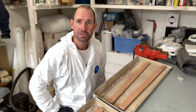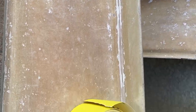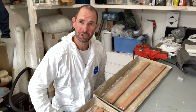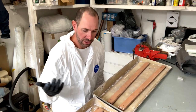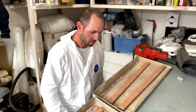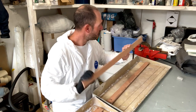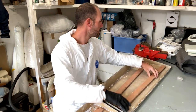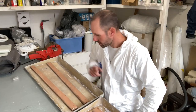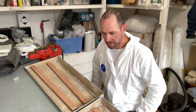I've just spent a wonderful hour or two cleaning up the inside of these locker lids outside. I didn't record it because grinding polyester is a horrible job at the best of times. This had a mixture of paint and gel coat and flow coat on the inside which I can't really bond to — it's now all off apart from a few bits. I've marked up where I want my little wooden formers and stringers to go in, so the next job is to glue them on. Once that's gone off I can lay up glass, flip it over, and then start looking at all the other repairs.